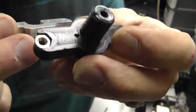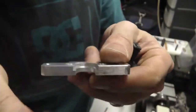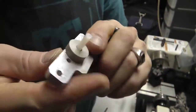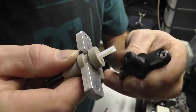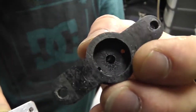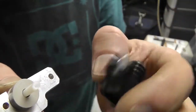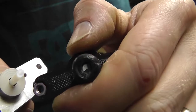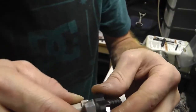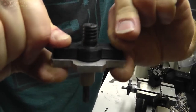Alright, so on my printer the original mount looks like this with the J-head plate that I made. In this case it fits like this, and I've cut this. You can't really tell, but there's a tiny little slot in there where the PTFE stops, and this whole diameter is actually smaller going through this plastic part. So I made this fit just right, and it clamps like this.